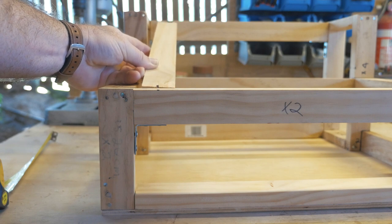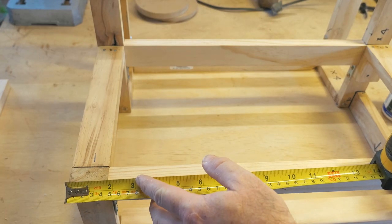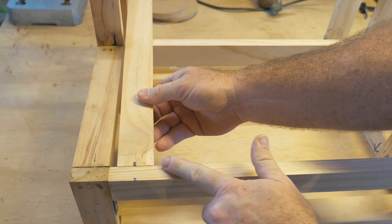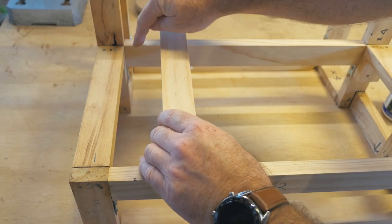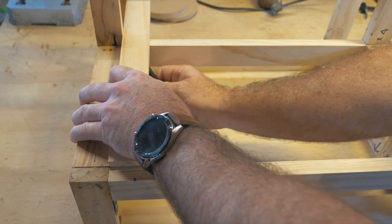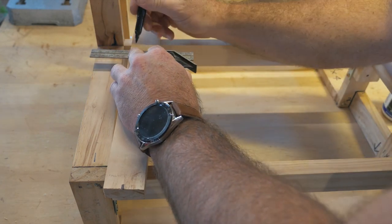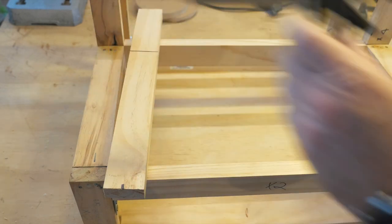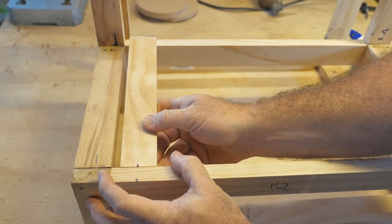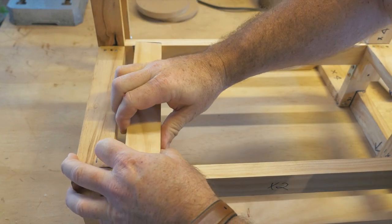This will allow us, when bolting our two guitar necks down to the board, three inches away from the side. I'm checking it again — it is three inches — and we're going to line it up so the mark in the middle of the frame lines up with that three-inch mark. I'll push it up against the side and use a pen on the inside just to mark it, then use a square to square it off. That part is what we don't want, so I cut on the outside of it. Here's the part after I've cut it — you can see it's a nice firm fit.